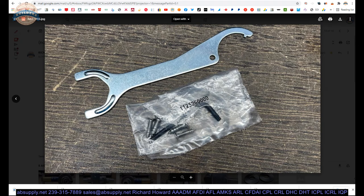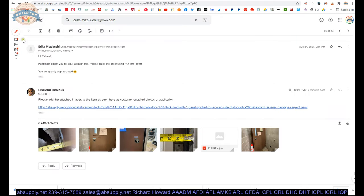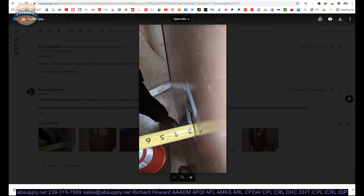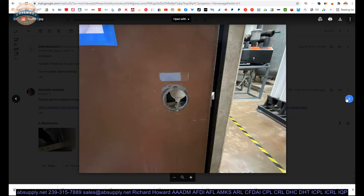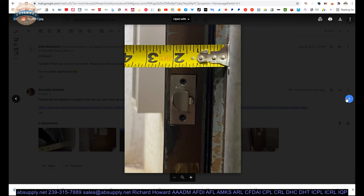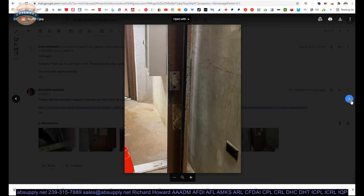The opposite side, your two levers, showing the Sargent large format interchangeable core. Your roses and your threaded collars, your accessory hardware, the wrench and the screw package. Now let me show you the actual application — this client stuck the tape measure through the door showing that it's two and three quarter, and here's this odd looking door. It does appear to be much further back than a standard latch bolt would be — that's showing the egress side.